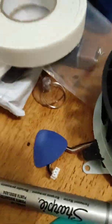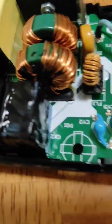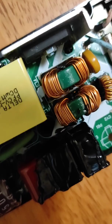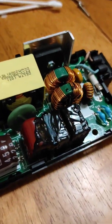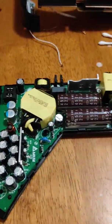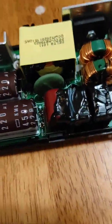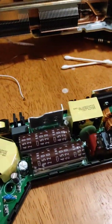I squished it down with what is basically a guitar pick — I have millions of them because I fix phones, I fix PS4s, and I do all sorts of stuff like this. I'm going to let them harden for like 15 minutes. I caked it all the way around, even on the back side. I got some of the goo on that other capacitor — the transformer-type thing. I'm not touching anything with my fingers, nothing metal. I don't want to touch metal to metal, don't want to get zapped. Caking it full of this stuff — this stuff stinks like paint thinner, like contact cement. It's really stinky, so try not to breathe it in too much.